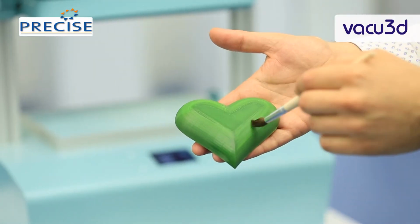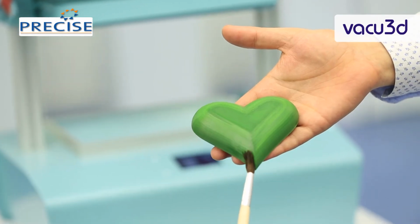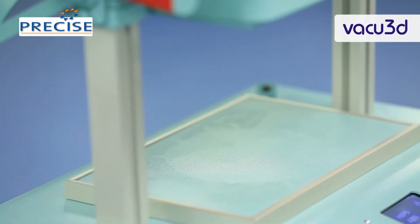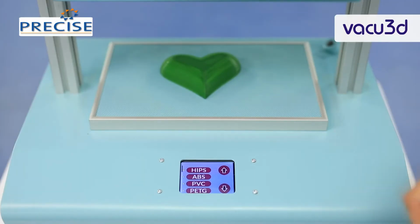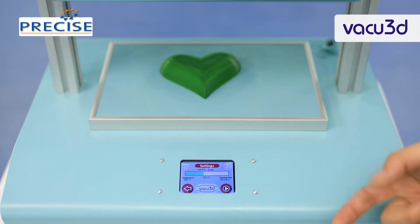Cover the startup model in spray model separator or slightly grease with petroleum jelly or oil. Place the startup model in the middle of the bed. Press the HIPS button, select 1mm, and then press play.